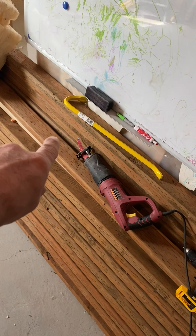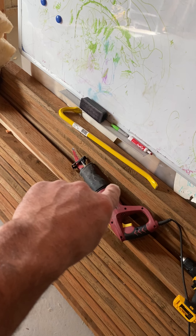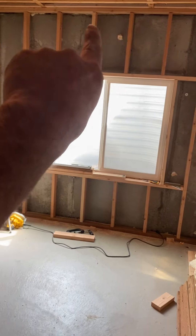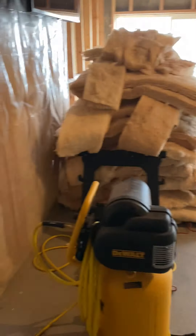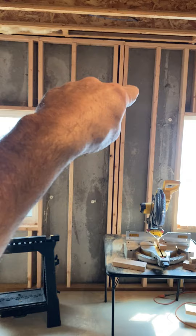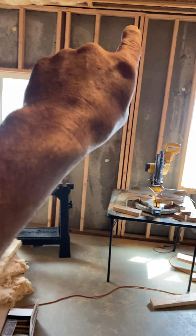On the other side, put a 24 by 12 baseboard grill. This is going to be a bedroom, so put a 14 by 8 baseboard grill for this bedroom and a 4 by 10 supply over the window. He decided to make this a bedroom, so put a 7-inch top takeoff over here in between the two windows to a 4 by 12 by 7 end boot.